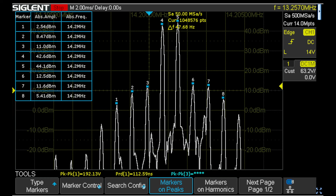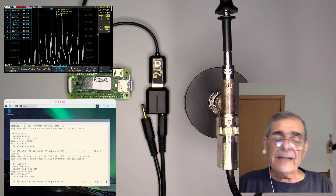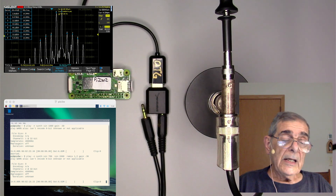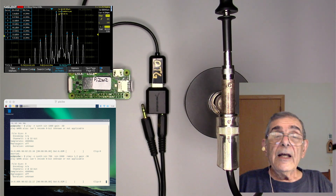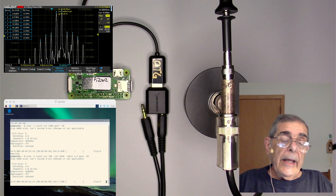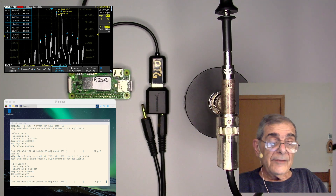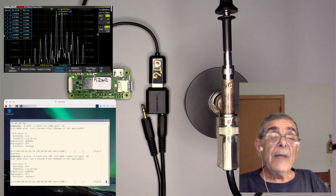As you can see, we've gotten quite comparable values to those from other published tests of this radio. The distortion products are generally minus 40 dB or so below the reference level of 100 watts. If you examine the peaks outside of the USB passband, they all appear to be well below the reference level. This is a very clean transmitter. I hope you enjoyed this video and find it useful as a starting point if you ever need to set up IMD tests of your own radios. You'll want to do some experimentation to arrive at the exact SOX command details, your microphone connector wiring to keep noise and hum out of it, and your level settings to avoid overloading your microphone input. Hopefully this video will get you started. Thank you for watching, and 73 now from AE0GL.